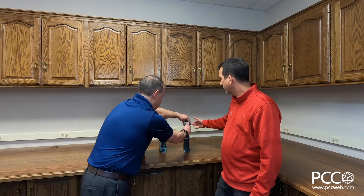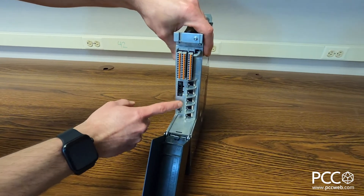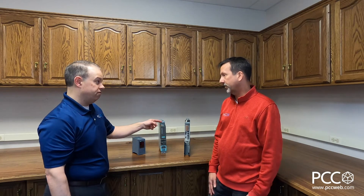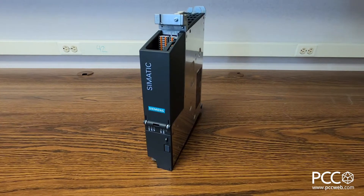I was looking at this earlier and I noticed there were five ethernet ports on that unit — what's going on there? It's got three separate ethernet PROFINET networks. One of them is a three-port PROFINET switch, another is a second PROFINET interface, and the third is a lower-level PROFINET — so there are three distinct, separate IP addresses. Three ethernet network interfaces onboard that device. I see other solutions in the market where you're adding more ethernet cards to the rack to get more IP addresses to segregate communications, and this has three of them on board. That's pretty significant.